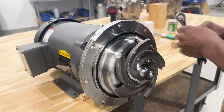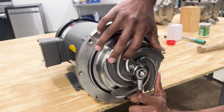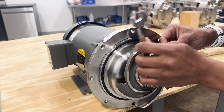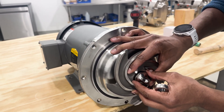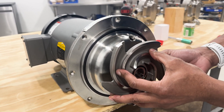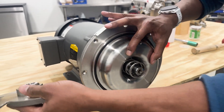What we're going to do is press down on our impeller. Now normally these would be torqued. Currently we have these hand tight, and as we loosen we want to just add a little bit of pressure onto the impeller to allow easy movement of the nut so we can quickly disassemble. While keeping pressure on the impeller, we'll then put our hand on the back cover and gently glide the impeller off of the shaft. We'll set that aside.